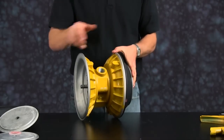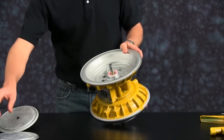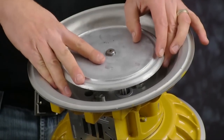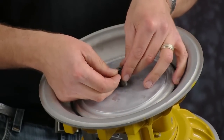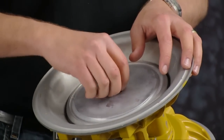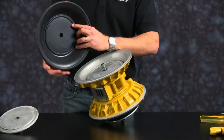Now we are ready to install our opposite diaphragm assembly. Install the plastic washer on the opposite side. The inner diaphragm plate radius will face towards the air side of the diaphragm. Install our sealing o-ring. Note the air side of the diaphragm will go towards the inner plate — in this case it is natural bulge out.